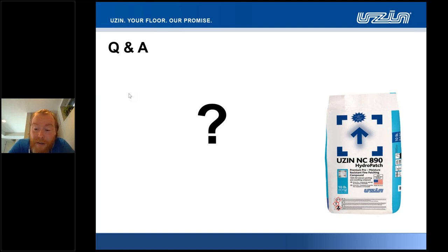That really is a misgiving, and really needs to be ascertained upfront first and foremost by review of the finished goods floor covering manufacturer's website, visiting the particular product page that relates to that floor covering. If need be, pick up the phone to these guys. They get paid to do that for a living, in answering your technical calls and ascertaining, first of all, okay, what is the key driver in play here? What is the maximum relative humidity tolerance that this particular floor covering can go to? That then drives the system of products placed beneath it.